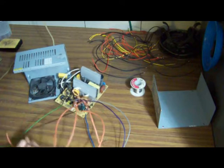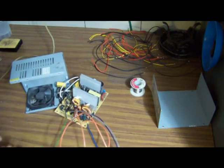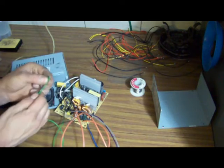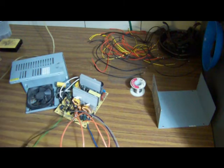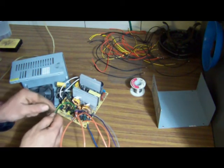I reattached one of the black wires to ground — that just makes it easier, because if you wanted a power switch on your supply, these two wires would be shorted together or would go to a switch. It just makes it easier to wire and easier to understand when you're troubleshooting. If you don't remember what you did, you physically see these tied together and you know why.